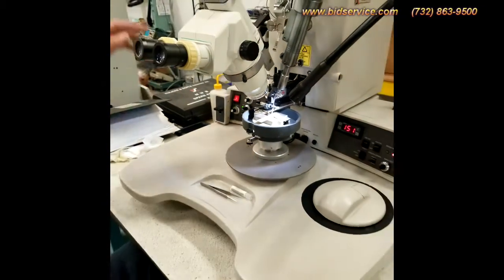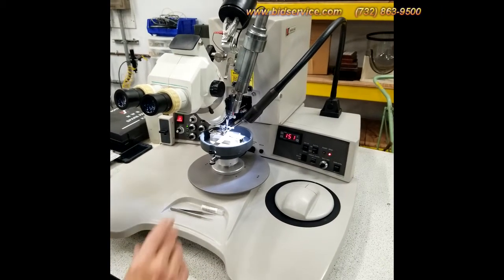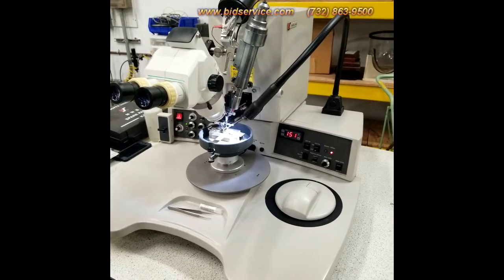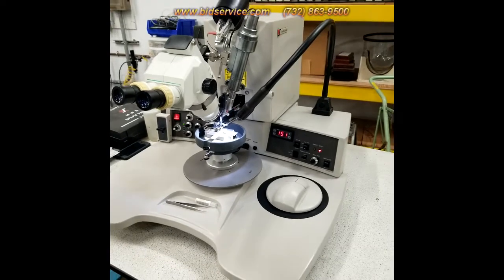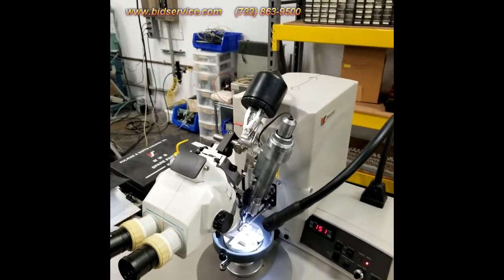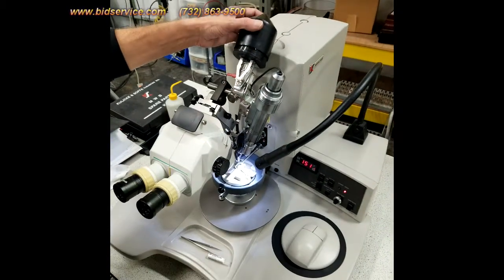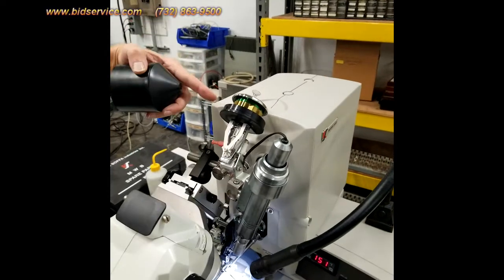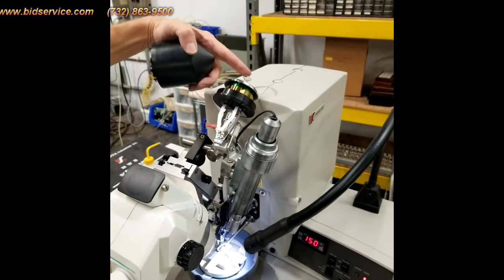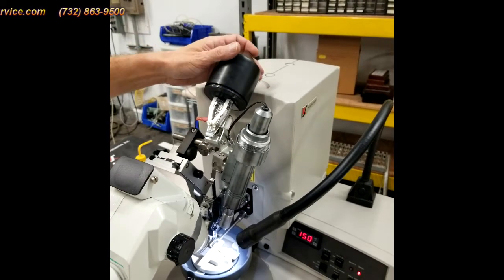The other thing I want to point out is that we had to replace the microscope. The other one had a problem with the alignment — I was actually seeing two images on there. So we put a new microscope in here for you, and again you do have the spotlight generator targeting system installed. I'll send along the case to indicate it's a one-mil capillary, and I'm using one-mil gold wire. You're going to have to purchase your own wire, so I'll send along the glass feed tube and the plate up here — I'll package that separately for you.